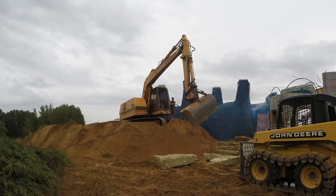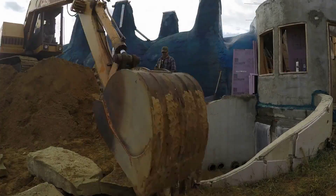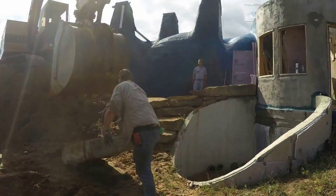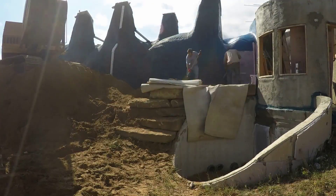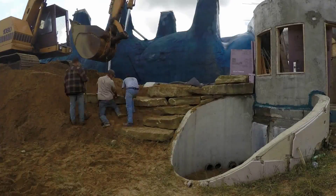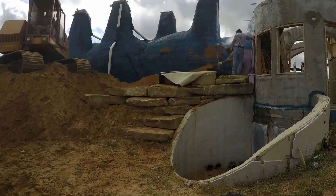We got a few boulders in place that day, but the day was pretty much over. The next morning we started with that boulder retaining wall. Steve — not a Roe brother or Roe son, but dating a Roe daughter — had good rock puzzle instinct, and the two of us worked together pretty well to plan out a spot for each piece. The objective was to gain a lot of height quickly and in a stable way, but the constraints were that we had a limited number of boulders. We started out with rock steps carefully and tightly fit to get up to the window level. Carpet was used both in horizontal layers behind the wall to reduce lateral loads, and vertically against the back of the wall to prevent any erosion from going through. We would flip the carpet forward for backfill and then flip it back again to add the next row of rocks, all the way up.